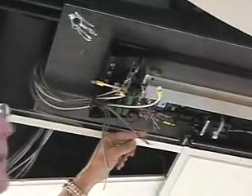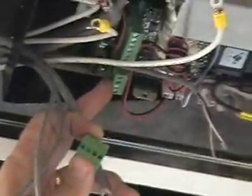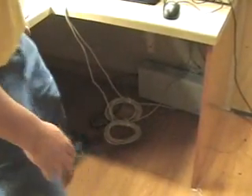Remember, power is red on the outside, then black. One of these power connectors will take two of them: red on the outside, black, and then red on this side and black. The third power cable will go to this connector the same way. We need to dress the power supply correctly — clean it up, put the cover back on, put the wires back in, and then take the power cord and plug it into the outlet.